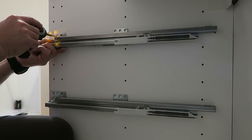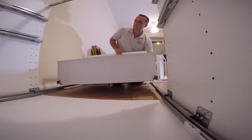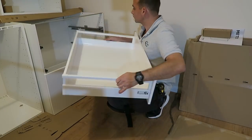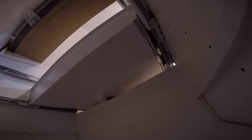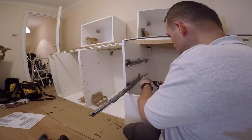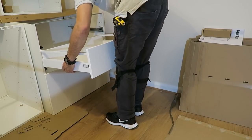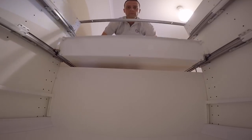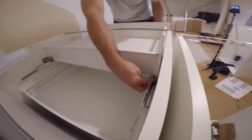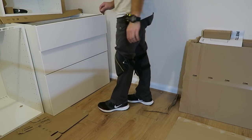Just check out the holes in this case. Right now I made a mistake, so the second one is not going to come in - I'll fix that later. The first one is sliding nicely in. If you did everything right it should be fine. I made a mistake so the front - I have to move them one hole up. Make sure you check that out before, otherwise you have some extra work as I have now. I moved the rails up so we're all fine now. We can slide it in nicely, and the top one exactly the same - just slide it in, it's going to click automatically. It's locked in place. That's how the Method kitchen drawers work.